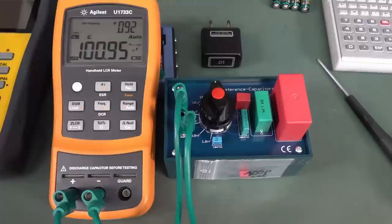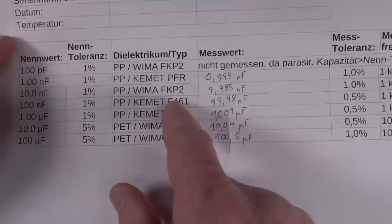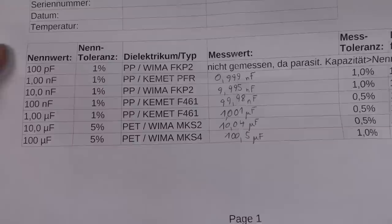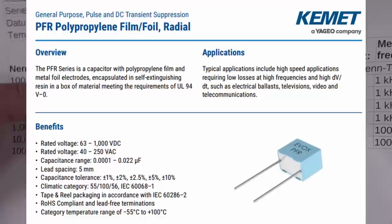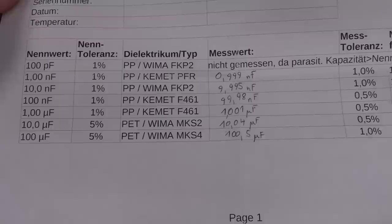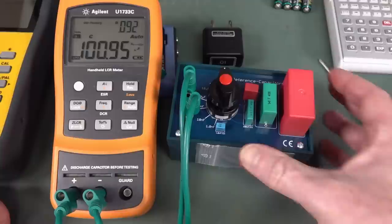Measuring on the IET it reads higher again, but I think my Agilent is the higher spec'd meter. We've got 0.999 and 9.995 there. This is reading a bit low according to my meter. And 99.85. But once again the whole idea is that you can use it to see if your meters are drifting or comparing different instruments. I don't have the best leads here - they're relatively long and I don't have short leads.